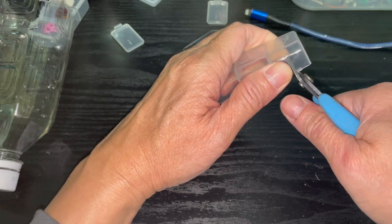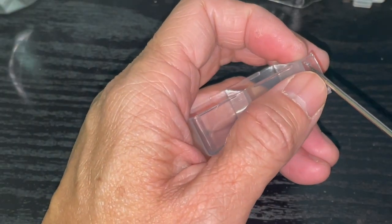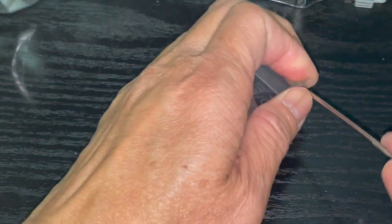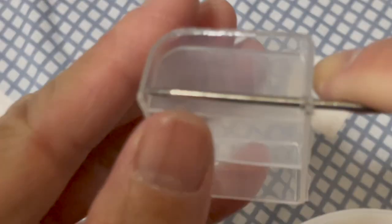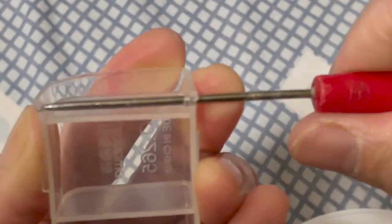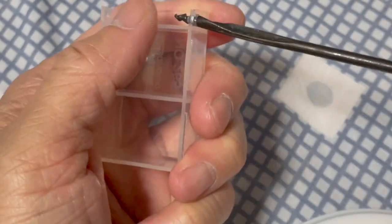So this type of pill box comes in three in a row. We just need to cut the last row in half. Just leave enough space that you can drill a 4 millimeter hole, still with 2 millimeter at the side for buffer.